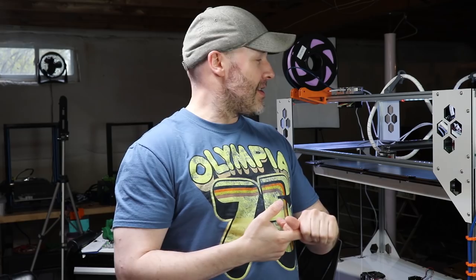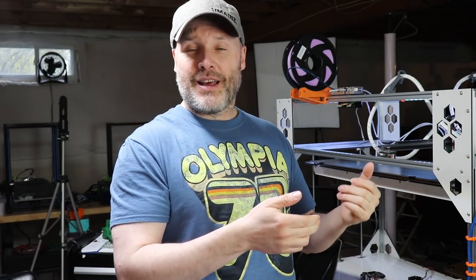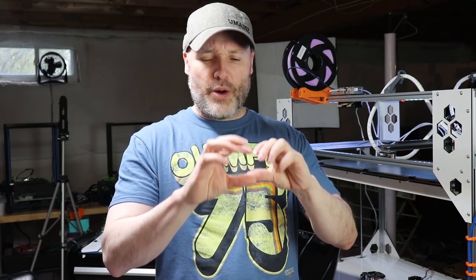What am I not crazy about? I'm not crazy about the RJ45 connecting into the gantry and that whole bit. I understand the premise and there are a lot of people that do it with no issues whatsoever. Unfortunately on this printer, I've had a tremendous amount of issues with noise and some quality control issues with the PCB. To make the BL Touch work, we had to add capacitors to the limit switches, because the limit switches on here are not the red ones that have a capacitor built in.